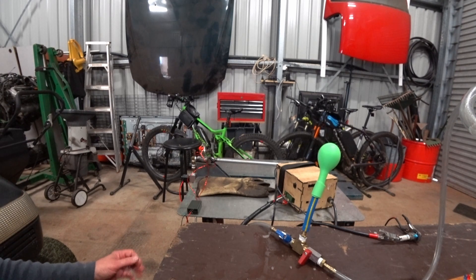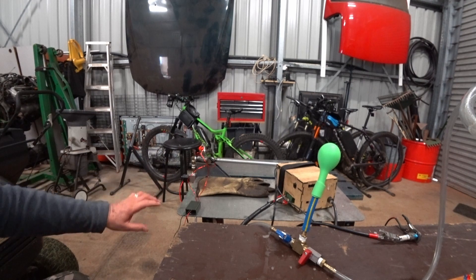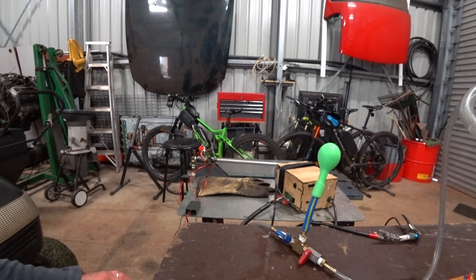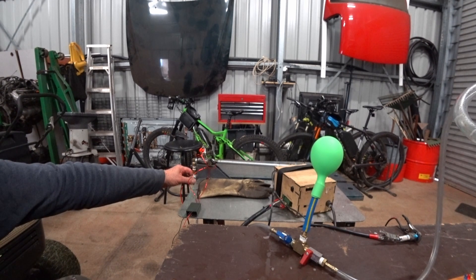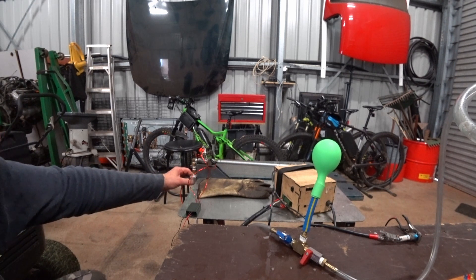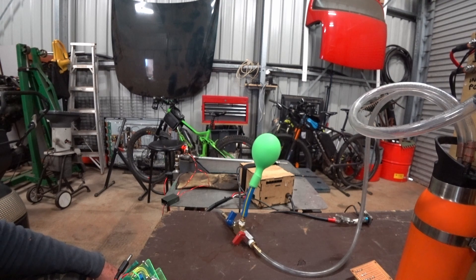The timing is firing after, so I may have to change the Arduino so that the solenoid pulses first and then the spark fires. Whereas with the coil, it could be something to do with the coil collapsing. I'm going to try and fire this spark closer to the pulse — instead of leaving a delay, I'll try to manually fire it as soon as I hear the pulse. I've also increased the volume of each solenoid pulse by nearly three times, so there's three times as much gas going in. We'll manually fire it again and see how that goes.